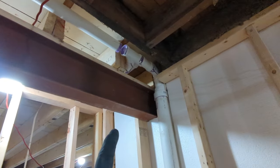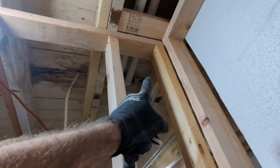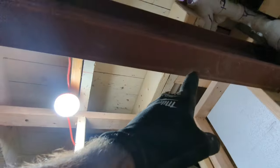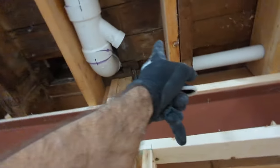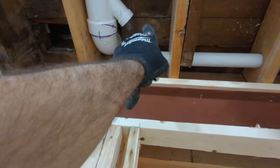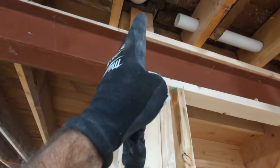But really what he might want to see, and I've got to be prepared for this, is for that venting route on the right-hand side as we look at it here to turn and go over and go up and connect to this vertical stack, if there's room. But of course the stairwell's here. That's in the stairwell wall. So I really don't have room to enter on that side, because if you go up, you're right in the door jamb, basically.